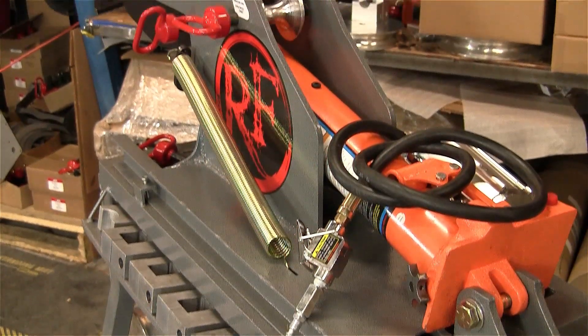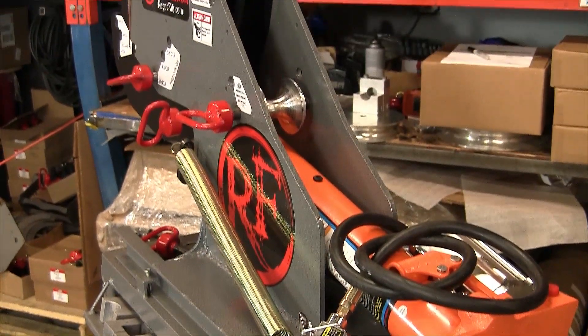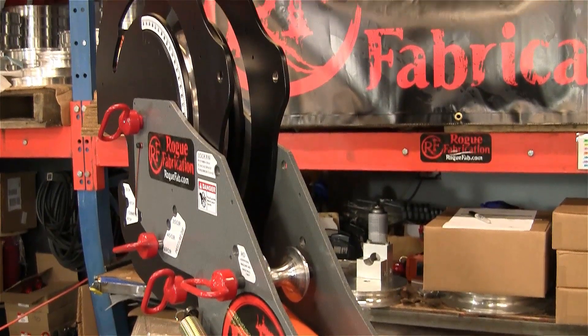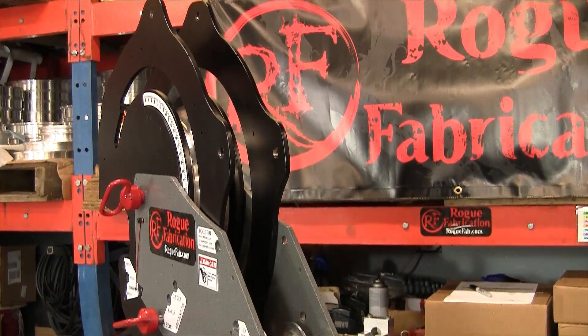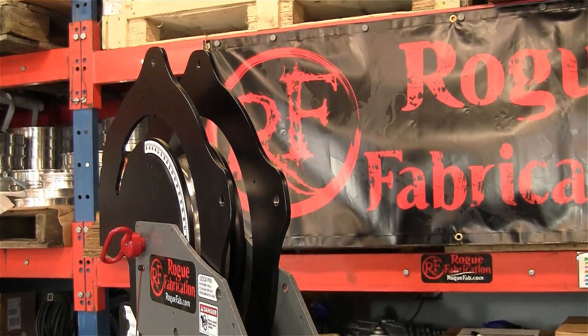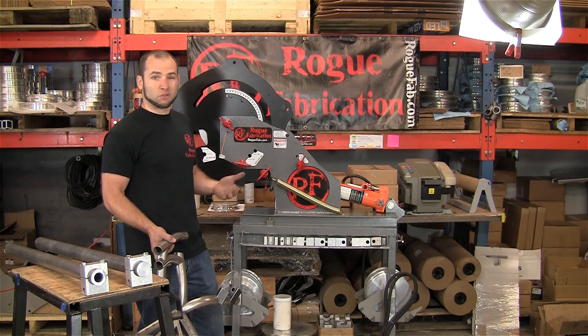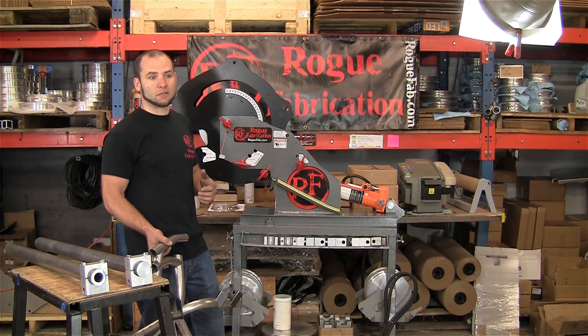This is the same as the Model 600 you've seen in our other videos, except it's got a thicker frame, a bigger diameter main bending pin, and there's a couple other little changes we made. All the same dies can fit in this machine if they're bored out, and its purpose is to bend thicker walled tubing, which would usually be used for lower control arms, some suspension components, and proving a point.